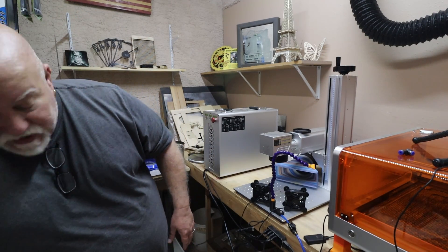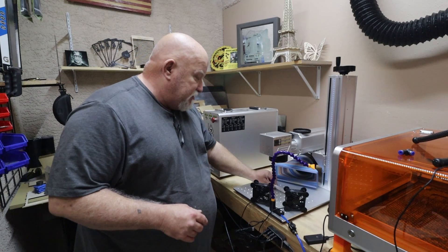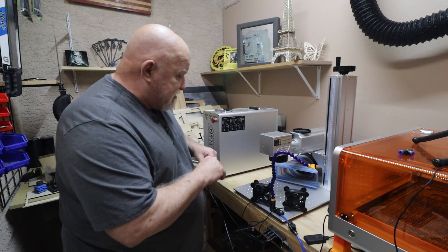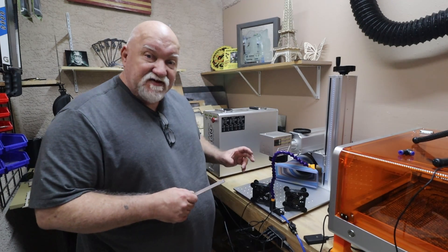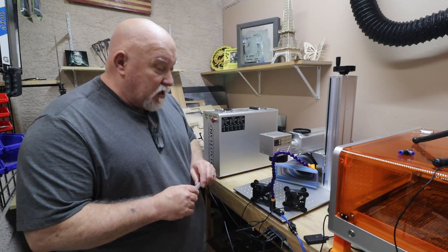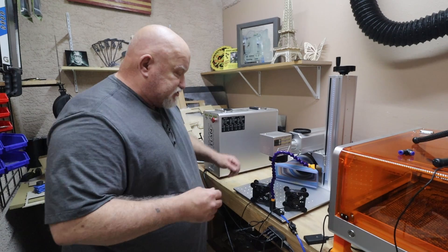But there's a better idea. I've got these little jigs here — two jigs that came with the laser for setting up your internal positioning precisely. What Jeremy has done is he has a couple extra of these and he simply doubles them up. He puts two down on either side of his work, lays his work down, and puts a second one right on top. He clamps it down with the four bolts so you can cut it completely out, spaced up off the bed — works perfectly fine.